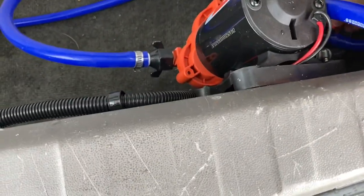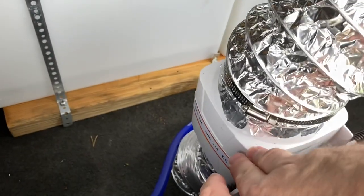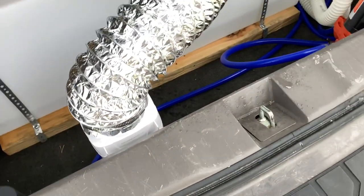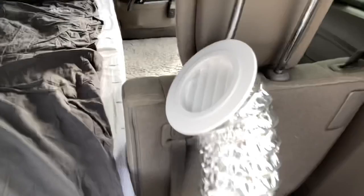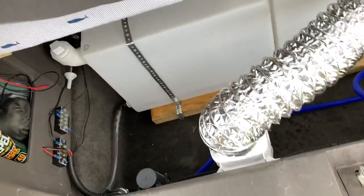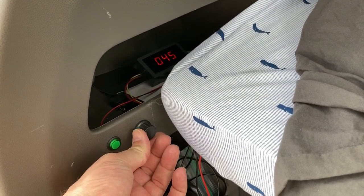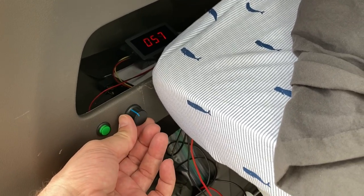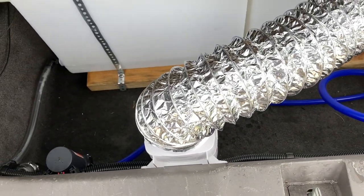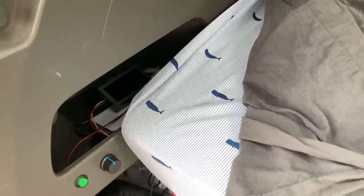This is the blower that goes down onto the floor — it's a bilge blower. It sucks through the bottom of the floor; it's mounted up high so it can't ingest water or anything. That's going to go into a panel up here — I haven't finished the panel yet — but it moves pretty good air. There's a switch in the front and a switch in the back, plus a speed control so I can turn the fan down to 50% or up to 100%. Even at 100% it's not bad, but around 70% is pretty good.